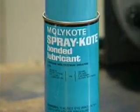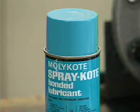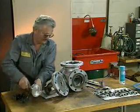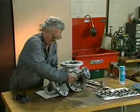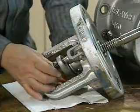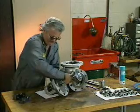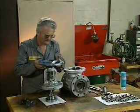Be sure to check the manufacturer's instructions to determine which lubricant is right for the valve that you are servicing. After all the moving and threaded parts of the valve have been lubricated, the mechanic puts the stem partially through the bonnet. Then he slides the gland follower over the stem and replaces the gland nuts. Next, he threads the stem through the stem bushing and replaces the hand wheel nuts and bolts and the hand wheel.